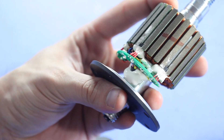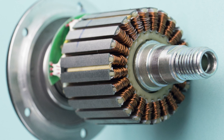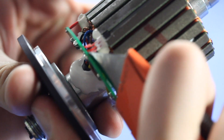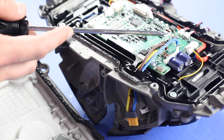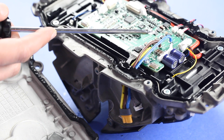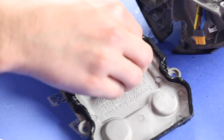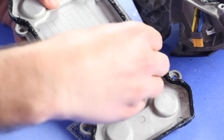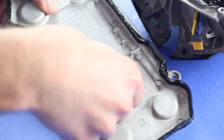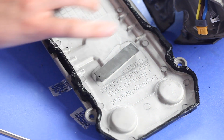The thing that interests me is looking at a bunch of other last-mile solutions — a lot of them use very similar off-the-shelf motors. If you look at a bunch of electric scooters, you can see the front wheels are all the same. This is completely not off-the-shelf. Here we've got all of our motor driver chips, which are going to get quite hot. What they've done is added this feature on this magnesium cast part, with this thermally conductive piece of adhesive tape, purely for purposes of dissipating all that heat into the chassis itself.